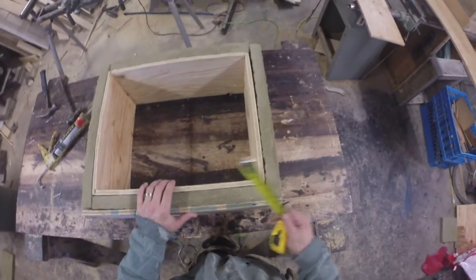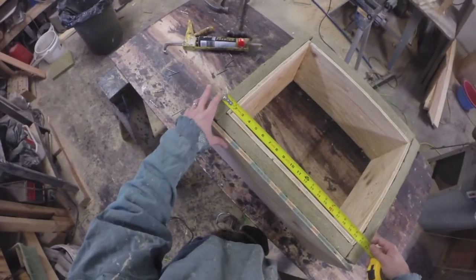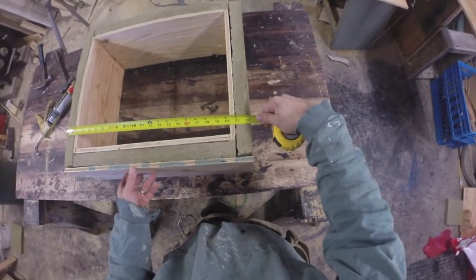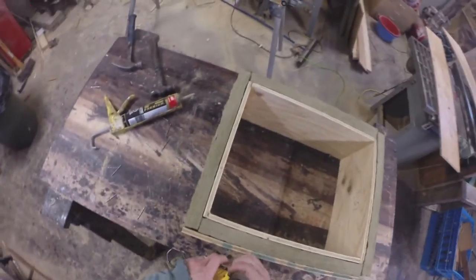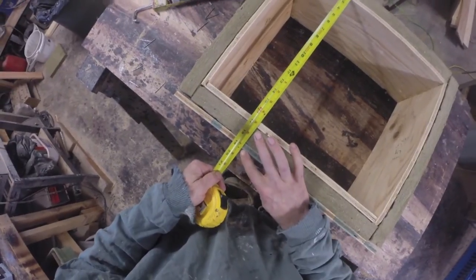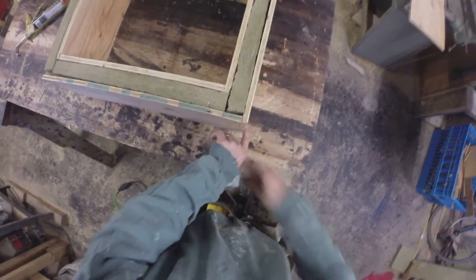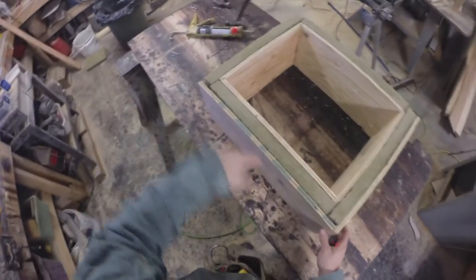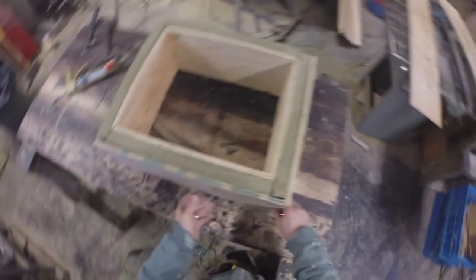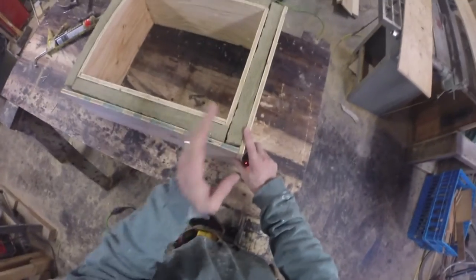Here are our four pieces of insulation cut. Don't pull too tight on the insulation because if you do, you'll make the pieces too short and have to start again. Just light pressure. This first piece is 22 and a quarter. Just keep cutting and check your measurements. If you're off a little bit, it'll all show up. I'm going to give that piece 19 and 1/8. I've cut it and I'm going to glue it and nail it, then keep going around the whole square. If your jigsaw cuts are a little wobbly, don't try to pre-cut each one — it's better to cut each one, nail it, and then keep going around.